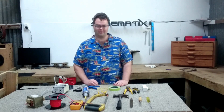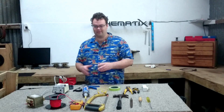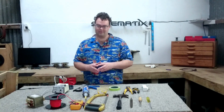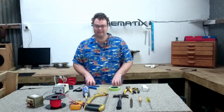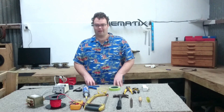How much wire do we need for our secondary winding? You can roughly work off the rule that one turn equals one volt. Each turn uses around 300mm of wire depending on the size of your transformer. With that info you can roughly work out how much wire you'll require for your secondary. Add a couple of extra meters just to be on the safe side so you don't run out.